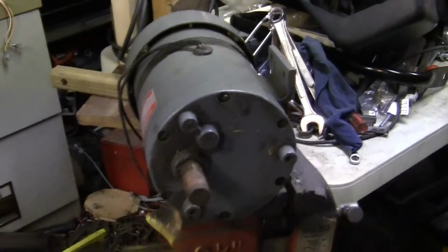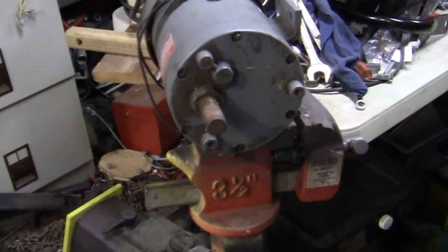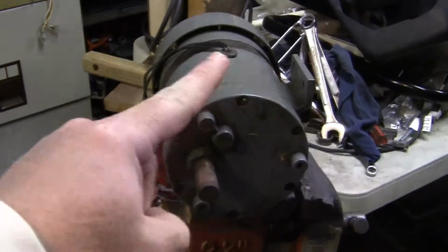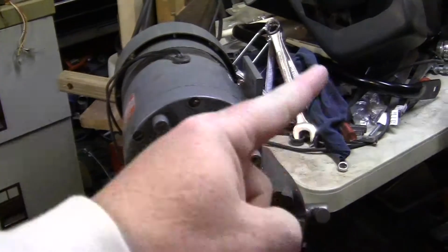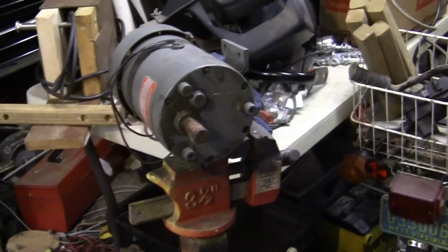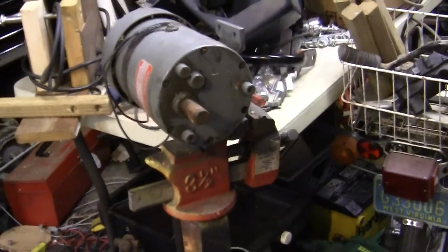If you know how a wiper mechanism on a car works, it's the same principle. As it goes around, half the circle on the back half is pulling the hacksaw this way, and then as it goes around, it pushes the hacksaw back that way. And then you just add weight to force the blade down into the material and make a slide, and that's basically it.